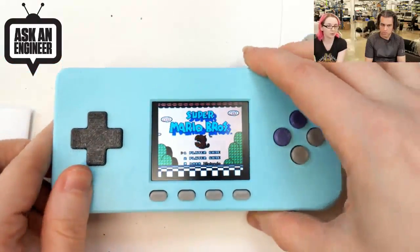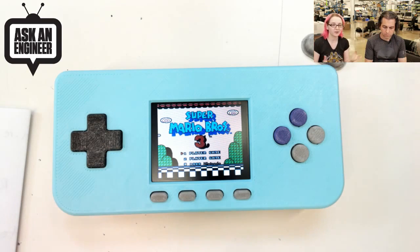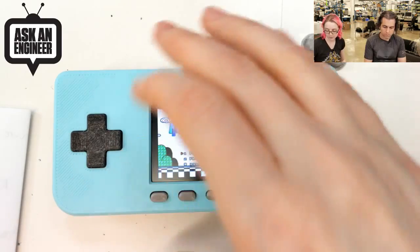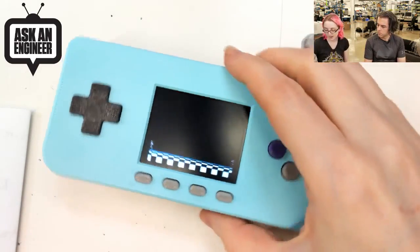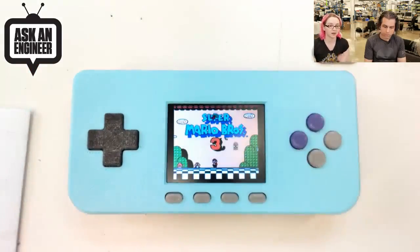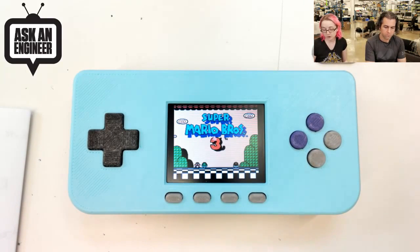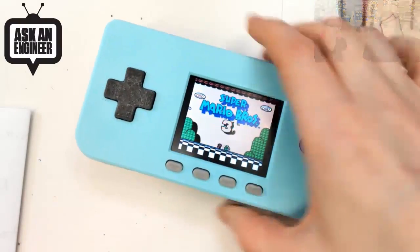I do want to warn people. It can play Nintendo games. Super Nintendo, not so much. So think of it as Nintendo and earlier is what it can pretty much do. There's no audio because the Pi Zero doesn't have audio. However, you can connect a USB audio converter here if you want to have headphone output, or you could use an I2S amplifier, which we'll be talking about, and modify it to add a speaker, but that's not included. But it comes as a project pack now. All of these parts, put it together. You'll have something nobody else has.